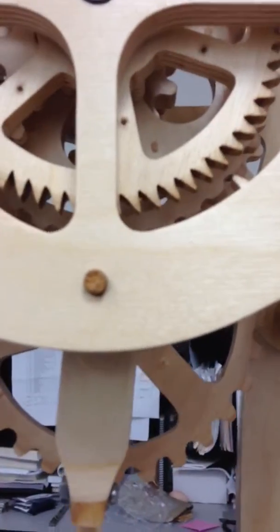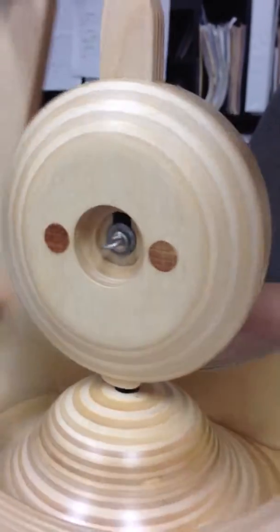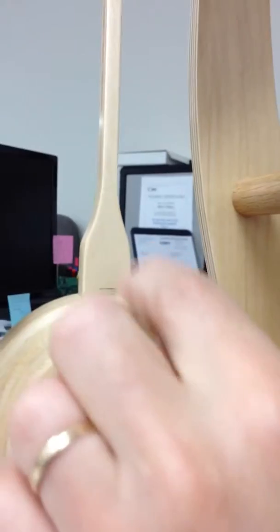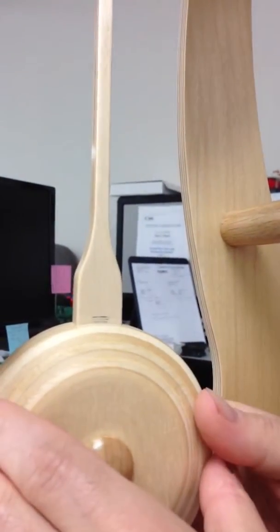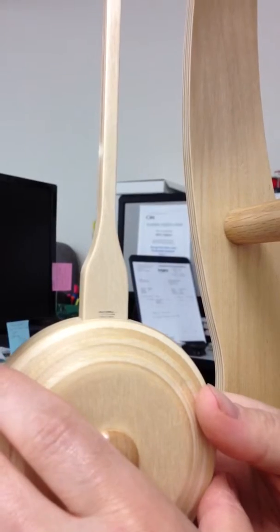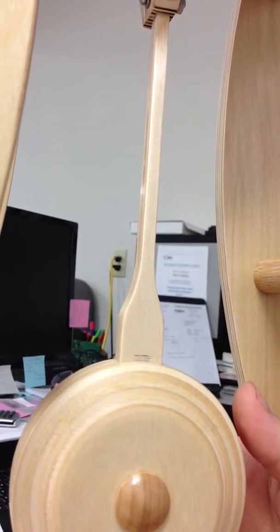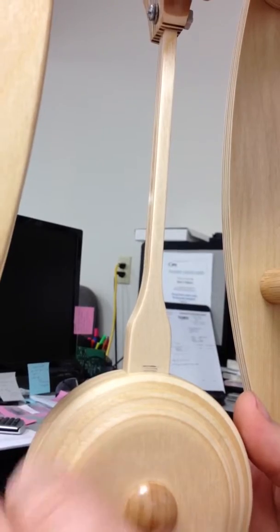You'd have to tweak it a little bit for adjusting the time. You move the bobber up and down for adjusting time — yeah, up and down. I've got marks here, probably hard to see, but this is where it had the most accurate time. When we first started out I had it only on that top mark, and as I saw that I needed to slow down the time, I moved the bob down closer to the base.